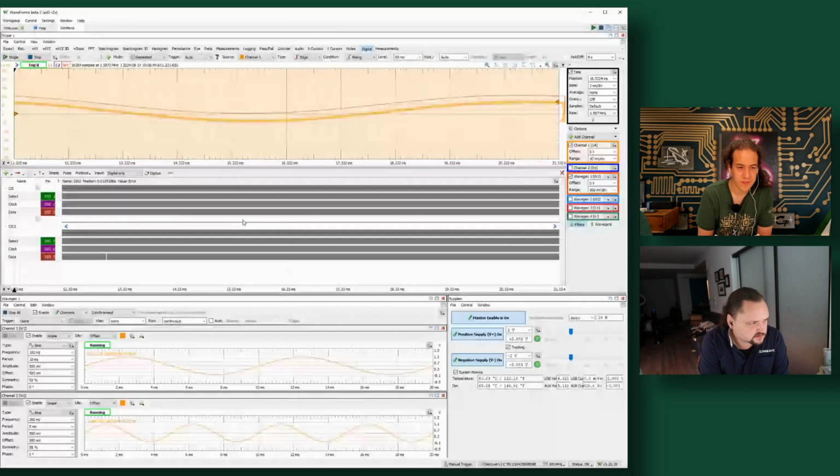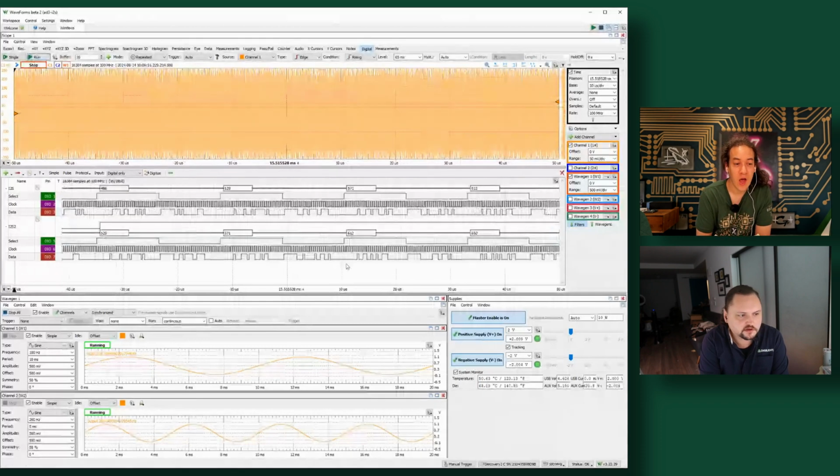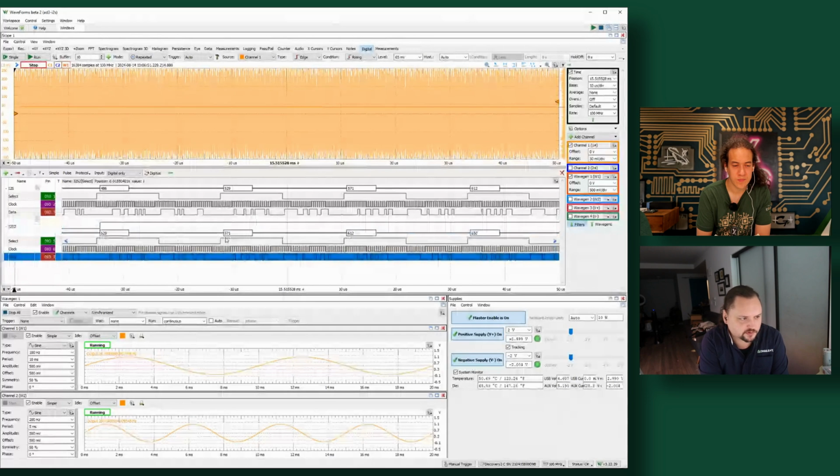The view above this, let me zoom in, is our digital line. Let me pause that so we can actually take a look. So that's the signals coming from the FPGA. This is just a straight I2S interface. There's the left-right audio channel select pin, a serial clock, and then data coming in. You can see it's being decoded for you in WaveForms as well. One of these channels is output, the other is input. The FPGA is fast enough that this sample was 571 here, and on the next cycle it's already being sent out of the FPGA. It's the same piece of data just flowing through.